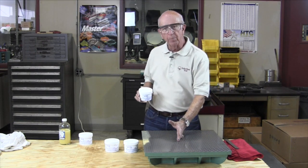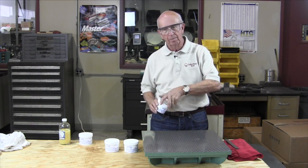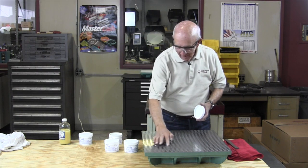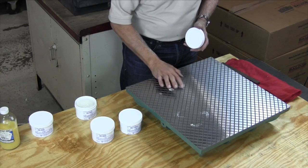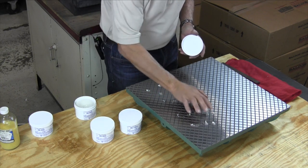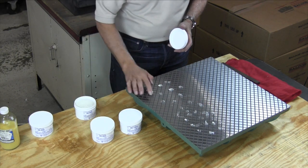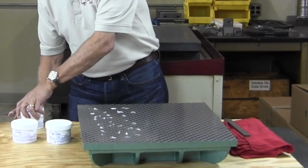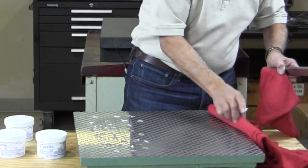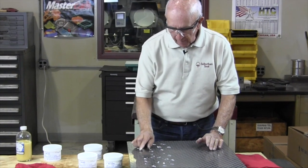I think 600 will work, and I want to keep the plate split in half so we don't contaminate both sides. We have grooves in the plate, and the reason we have grooves in there is so it will allow the lapping compound to get into that area. We'll start with this one first and see how that works — it will also tell us if our part is flat. Keep in mind we don't want to get this contaminated on either side.